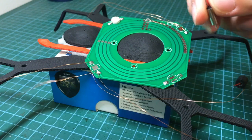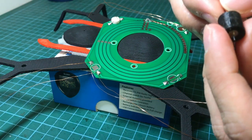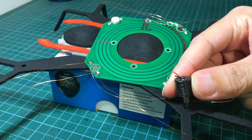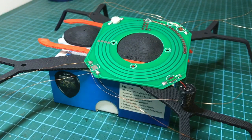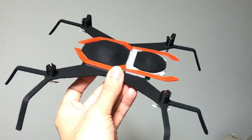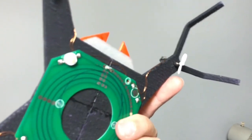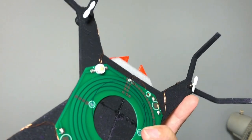This is easier. Here's the motor cap — insert it into the motor cap and let the motor drop out through the cap, like so. Then we let the motor drop through the hole here. There's one done and I'm going to do the other three, then we can solder the wires. Here's the Spider-Man drone — it's almost complete. The four motor wires are hooked up via magnet wires to the reception board. I'm using 28 AWG magnet wires, and the four tiny props are ready for show. I may change them to bigger props, but for now I'm using these tiny props to simulate movement.